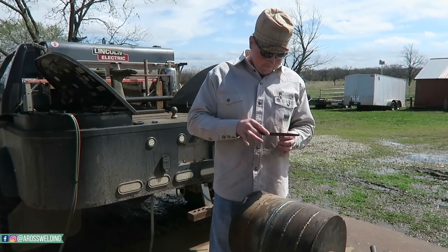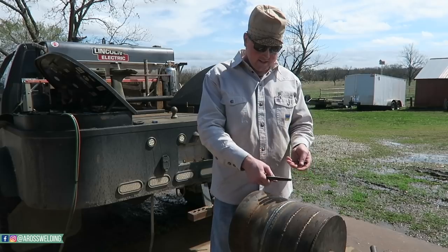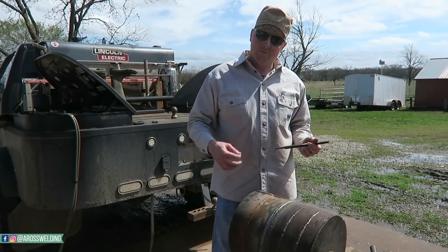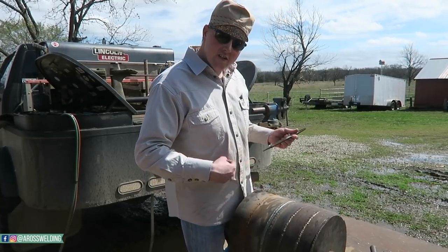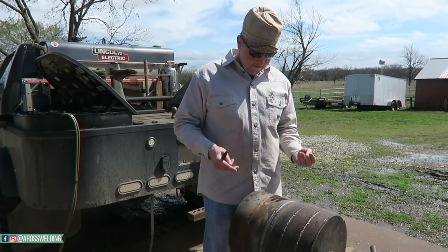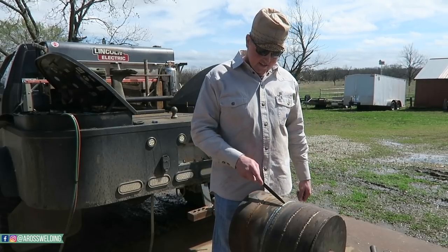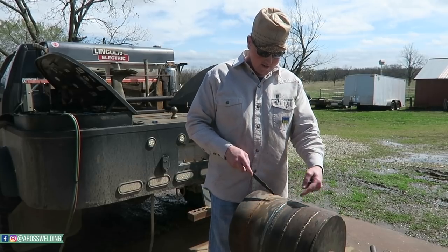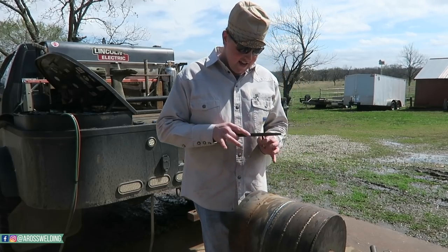They do have what they call a strap cutter, but I don't have one of those. It's a thing that sits on the pipe and you put your barrel torch in it, and it's got little knobs just like a beveling machine to spin it to go one way, and then you've got a knob over here to spin it to go the other way. But anyway, I'm gonna lay them out. Your average strap is usually 1 inch by 9 inches. And I didn't think about this. We're gonna have two welds here, maybe even three. But that's all right. This is all just for practice and example.